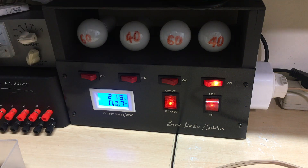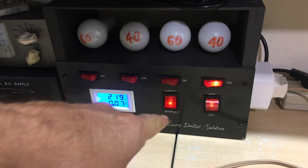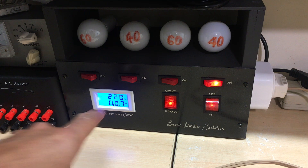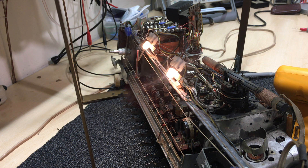The lamp glared on, which is what it's supposed to do, and then it dimmed down. We've got 70 milliamp current draw, 220 volts going to the radio. No shorts. And what we've got is the lights on — our heater voltages are definitely there. The two light bulbs are not burnt. Now I'd like to go and look at some of the voltages on the tubes and see that they're getting there.